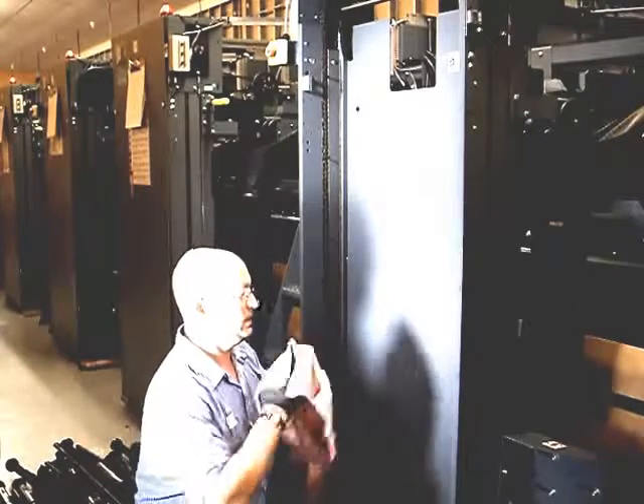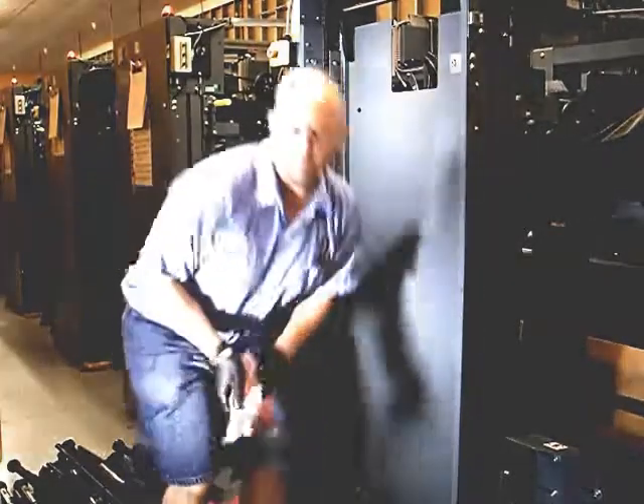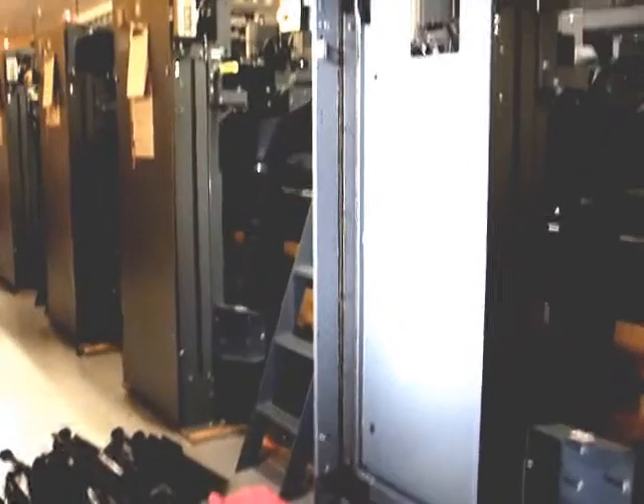I am going to show you some messy chains as well as a loose chain, which you don't want. I am going to get a flashlight to make sure we have excellent lighting. So we have got the chain right here — see how loose that is, that is not good. You shouldn't be able to see your finger past it. When I get the tension on these chains, I want the tightness to be where the chain is right there when it comes out — I don't want to see my fingertip. As you can see on the inside here, there is plenty of dirt build up; it is time for this elevator to be cleaned.